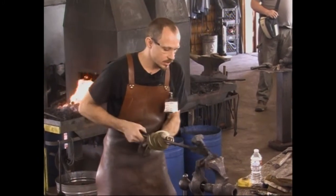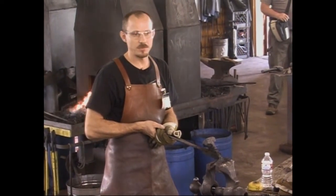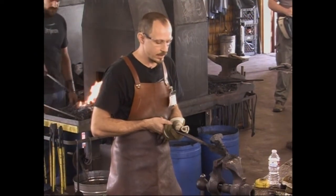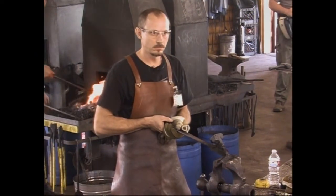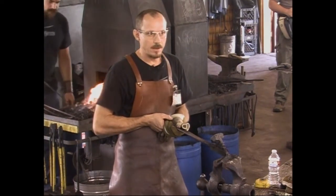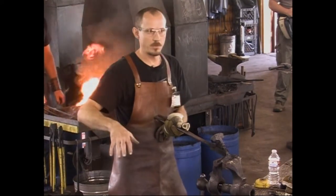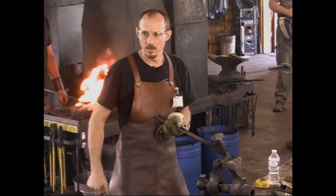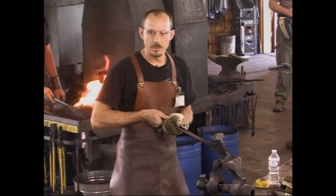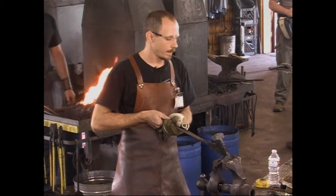If you go to cut this, the first thing is that this is a very tough steel. After they've been ridden on by trains, they are work hardened, very hard. So what I did is I torch cut a section of a rail large enough to fit into a propane forge. I heated it up slowly to start with, then I heated it up to bright yellow, buried it in vermiculite and left it for 3 days. Metal trash can full of vermiculite, buried it in there. After it annealed in the vermiculite, the bandsaw will cut it. It will cut really nicely.